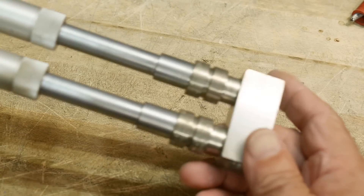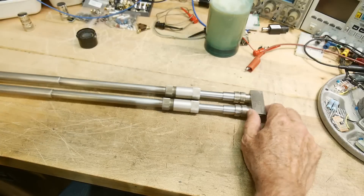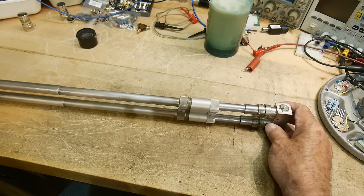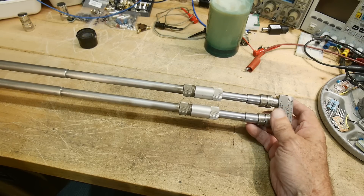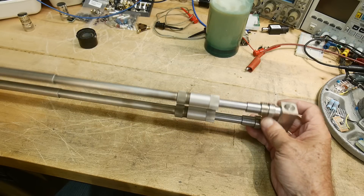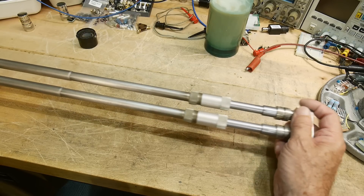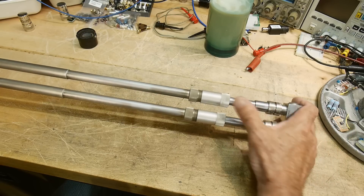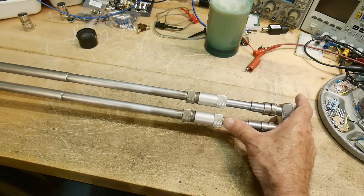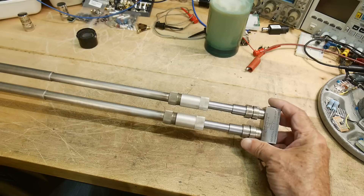What is a trombone? It just slides in and out, like I said. It was a pretty standard piece of test equipment. You may have used one in school; probably haven't used one at home. They're quite expensive — I spent a whopping $5 for this one. So I think what we should do is put it on a vector network analyzer and take a look at something you might care about: changing the electrical length or changing the delay. You're just creating a different electrical length or physical length of the transmission line, but the actual characteristics never change — it's just 50 ohms.